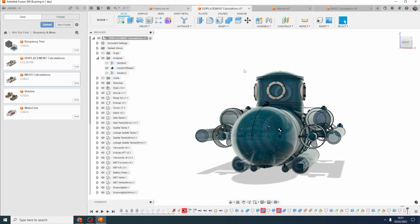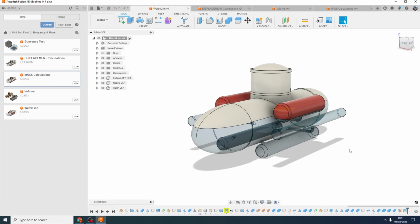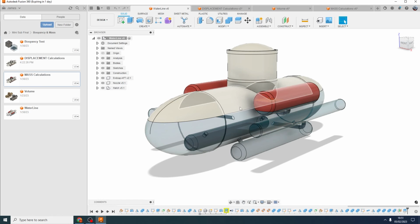I do want to just recalculate this waterline because it just seems a little bit excessively high, but I have done it again and it does seem to be right. I think it might be these tanks are providing buoyancy, so they're not going to provide stability, but they will provide buoyancy, so they are pushing it up, providing a buoyant force. I'm not sure whether I should just leave them there, move them up, or do away with them altogether. Anyway,